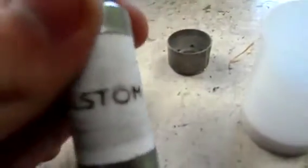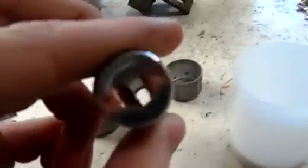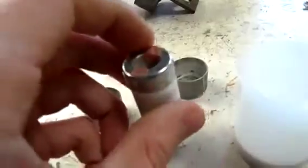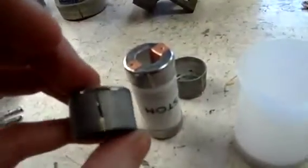That's a 63-amp MEM — it's got lugs on it for being bolted to a fuse box. We've also got an 80-amp Alstom here — apologies, running out of camera battery. I haven't taken the inner caps off that one, but as you can see the copper straps inside will both be 40 amps each.